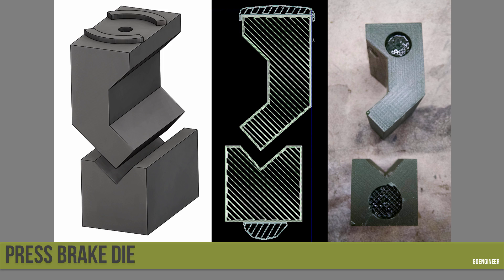The first part I made was a press brake die — a part that's going to see some compressive forces. This particular die shape is used to create 90-degree angles close to each other, and it has a cantilevered arm that's going to see quite a bit of bending force. My idea was to not change the design at all, but print it sparsely and then fill it with a urethane plastic. I can't say for sure, but it is more stiff and rigid, and it came at the cost of a couple dollars worth of resin.